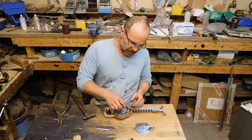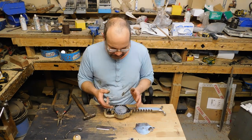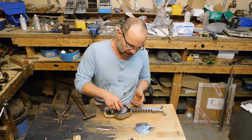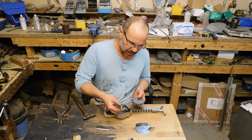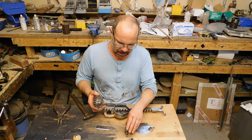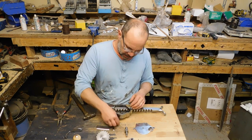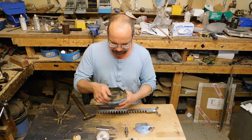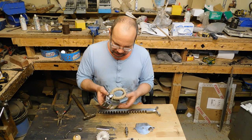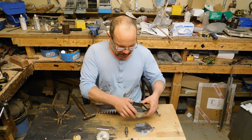So we have the top cap. What I try to do when I make stuff like this is I know that people want to be able to look at it and take it apart and show people and talk it through, because that's what we love about history — the weirdness of it. So I try to make my stuff as correct inside as outside. Here you can see the little pinion gear for the crank handle, the main gear and the pinion for that, a couple of washers, and then the rack itself. On the main casing I've tried to rivet everything that I can; what's not riveted is brazed.